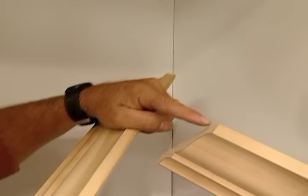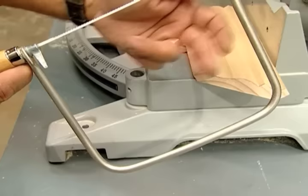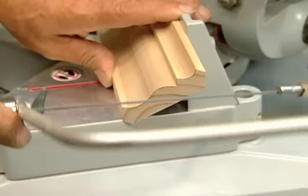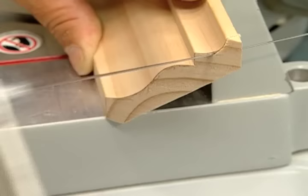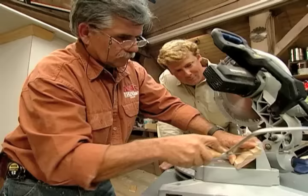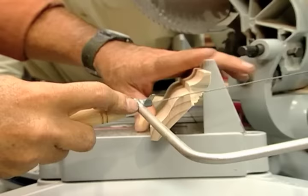The first thing I've done is darkened the leading edge with a pencil so I can follow it, and I'm going to cut that with this coping saw - the thin blade will curve right around to follow it. Hold it in the right orientation, keeping the saw level with the floor and tilting it back slightly. I just follow that leading edge; because the blade is so thin, it can follow the curve and even turn tight angles.